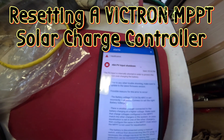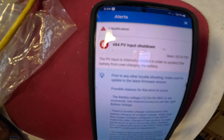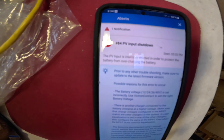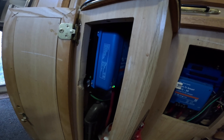I've got a condition here where my solar charge controller doesn't want to operate. Part of the problem is because we had a battery charger connected to the lithium batteries — I was inside the barn with no solar and couldn't run the truck, so the alternator wouldn't charge the house batteries either. We connected a six-amp charger that operates at a slightly higher voltage than the solar controller, so the solar controller went into shutdown. You can see the blinking yellow and green light. The cure is to disconnect the battery and solar panels, then reconnect.